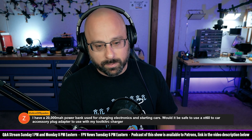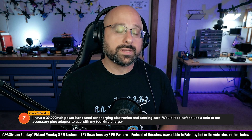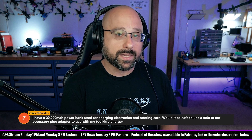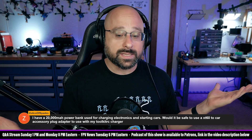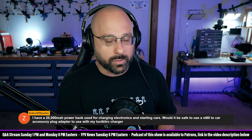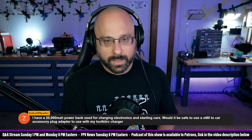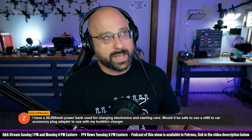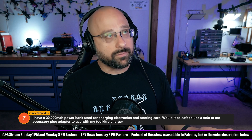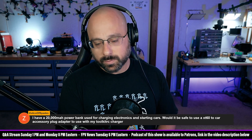Wesley Vardy asks: why 1s? Wouldn't it be more like 3s? Yeah, that's the question. Most of the time, if you look on Amazon and you see a 20,000 mAh battery bank, it's 1s. The reason it's 1s is that they're just charging USB and then they have a little step-up regulator maybe to give you 9 volts — but usually it's 1s because that makes the number bigger and it's simpler. If they're trying to jumpstart a car, then it's probably 3s, because it wouldn't make sense to have a step-up regulator that could carry the current required to jumpstart a car. So it's probably 3s — triple that number.